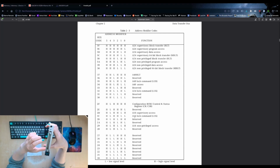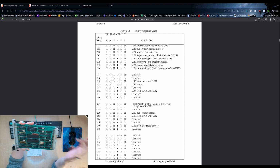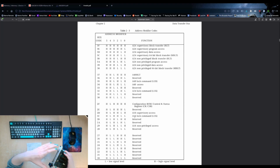This big connector, there's documentation available that shows what these pins are, and some of them are inputs, and then it will count how many times the input goes from low to high, for example. And then there's some registers on here, and you can essentially read what the count is. So it'd be used for control systems, for controlling some real world thing. You'd have some external sensor somewhere, maybe a proximity sensor, or maybe it's part of a process control in a factory. You'd have a sensor giving you a value, and then this card could count how many pulses happen, and then you read it.